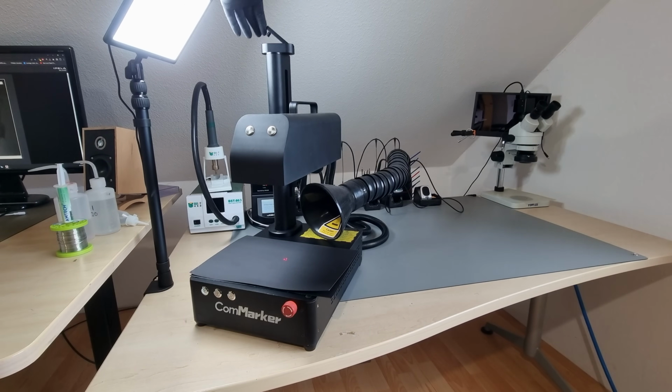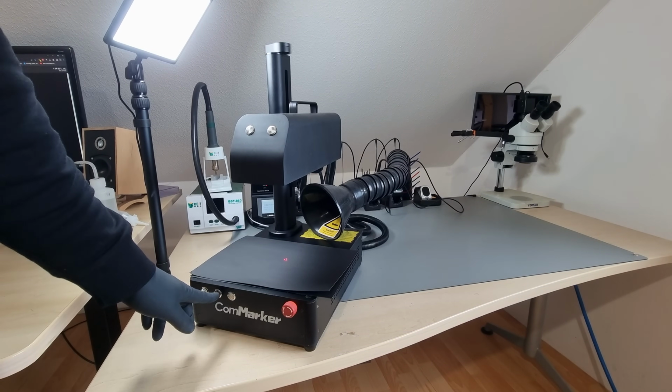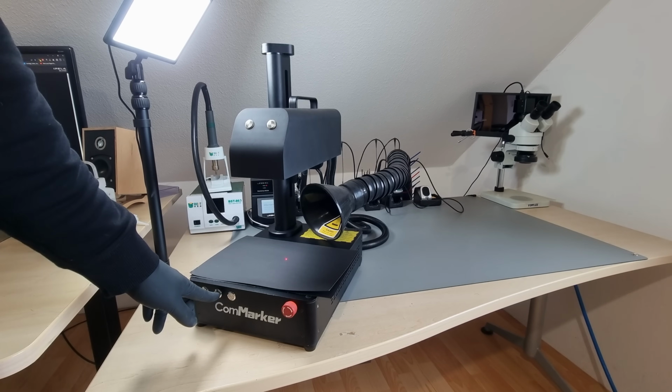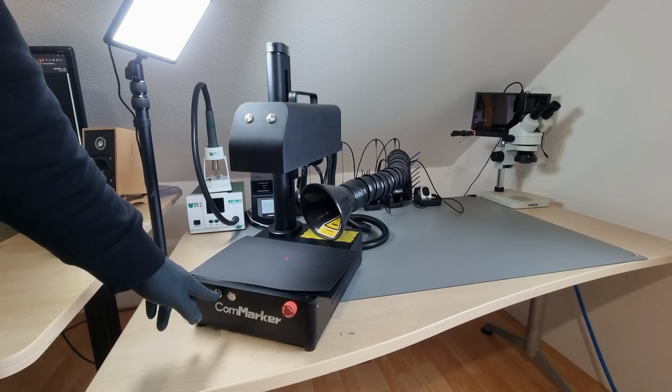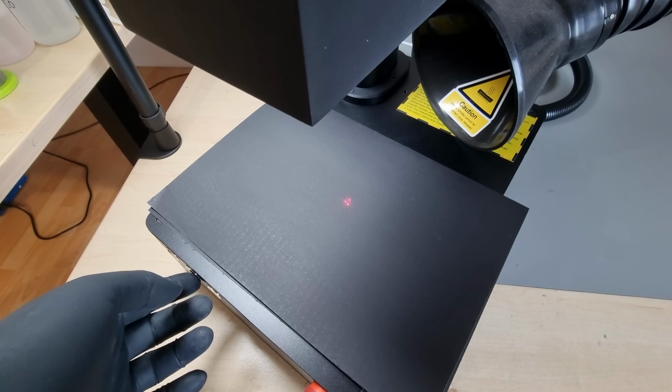To align the focal plane, which is about 200 mm away from the head, with the workpiece you can use a hand crank or an electric gearbox motor with controls on the front of the unit. Both are coupled by a threaded rod, so when you're hand cranking, you're turning the output shaft of a gearbox motor. They don't like that generally. And yeah, it doesn't feel safe to hand crank a lot, as if you're about to strip some teeth.